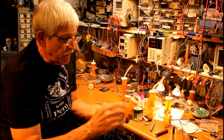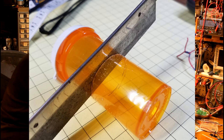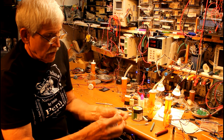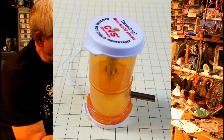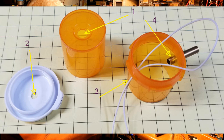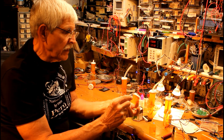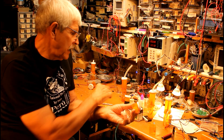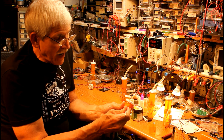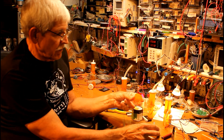The pill bottle itself — to get that ready, you need to cut it in half. The easiest way is to take a little razor saw, mark it carefully in a nice circle around there, cut it in half, and you wind up with two pieces. You need to drill three holes in that. Drill a 17/64ths-inch hole in the bottom — that's a good diameter for getting the threads to go into the hole in the plastic bottle. In addition, put an 1/8-inch hole in this section; that's where the wires are going to go through. And put a 3/16ths hole on this side for a piece of brass tubing that connects up to the pump to pump air through there.